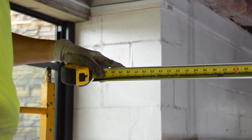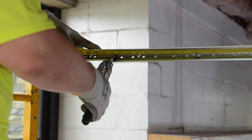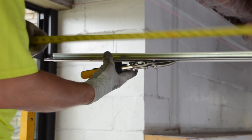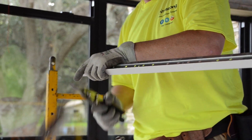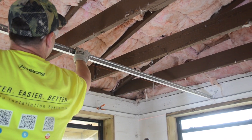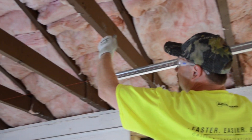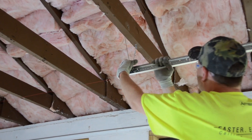Here we will cut the main — this is important. We will repeat measuring from the dry line to the wall for each 4 foot on center starting main runner that we install. After that, mains will continue on as full size main runners that always end within 3 inches of a hanger wire location. Notice how our perfectly measured main runner has a hanger wire hole within 3 inches of the main beam splice.